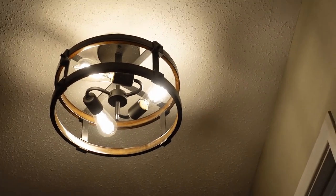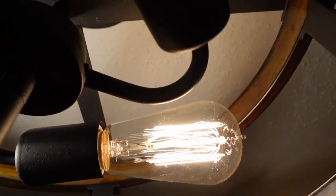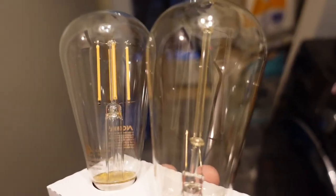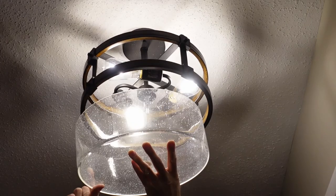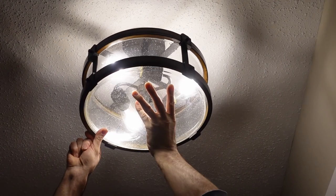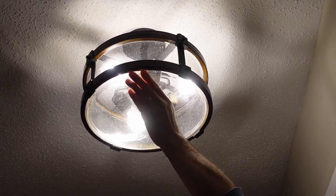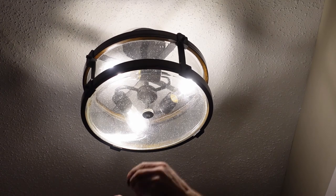Here's the new LED bulbs I got — only 5.5 watts per bulb instead of 60 watts, and they look very similar. The 60-watt bulbs that came with it have a lot more little wires inside which gives more of an old-timey look, but unless you're staring right at the light you don't really notice any difference. To get the glass on, there's a hole in the middle that allows the bolt to pass through — keep the rubber side of the washers against the glass — then screw the decorative pieces on to cover the unsightly metal bolts.